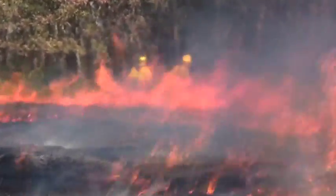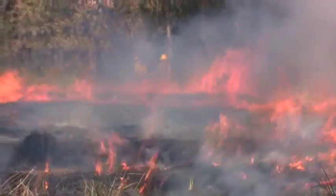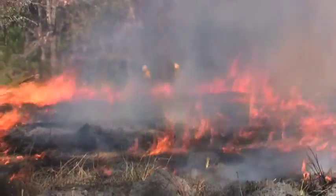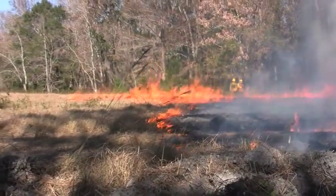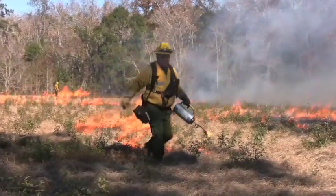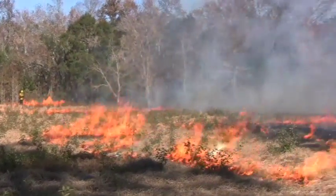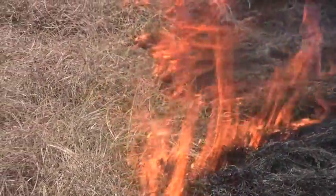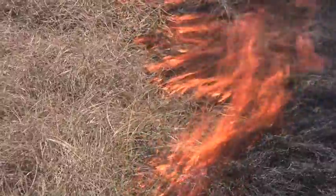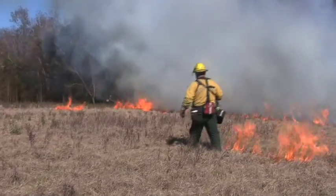The process is we put in fire lines initially. We have a pasture — this is all we're going to burn in this area. We use the bulldozers with the plow units to put in the fire line, removing the fuels. Then we'll come in with our fire pots and blacken the line, which is on the other side of where the wind's coming. When the wind hits that, it dies down, the fire burns back into the wind, and it's a small flame that backs in and burns up the vegetation.